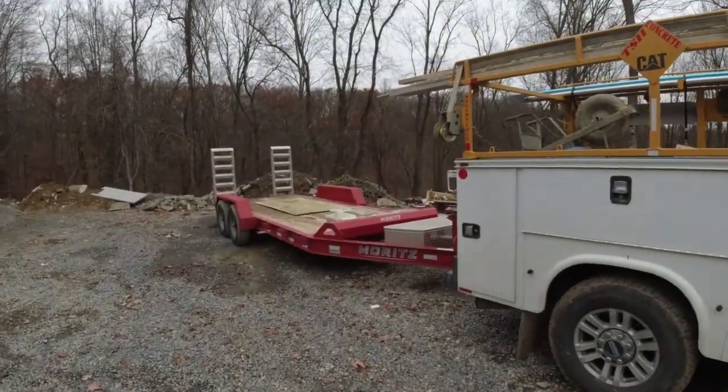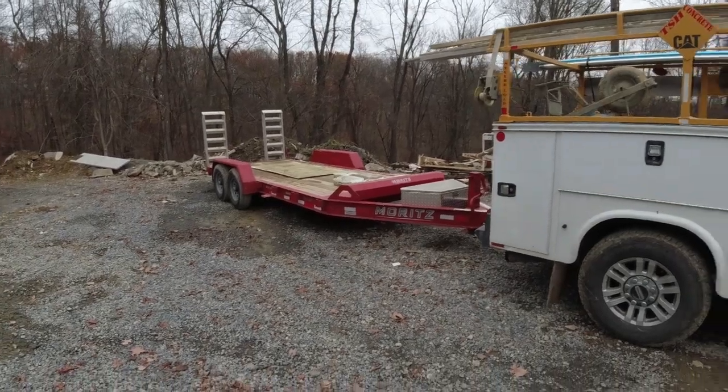So I usually do about 3 to 4 good handfuls. When we did weigh them out, I even forget the measurement. It's been so long since we actually did that, but it ended up being like 2 good handfuls and a little bit. So a little bit more microfiber is good, whatever. And then again, there is the sand and Portland.